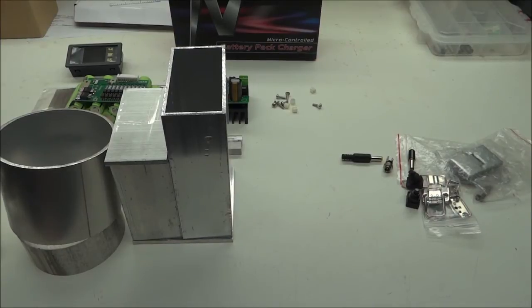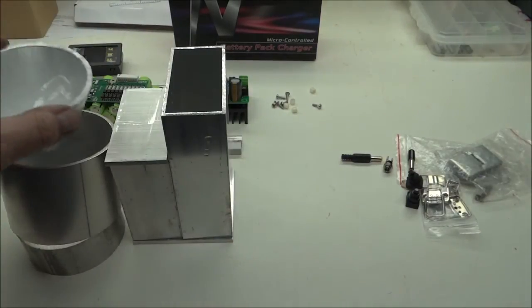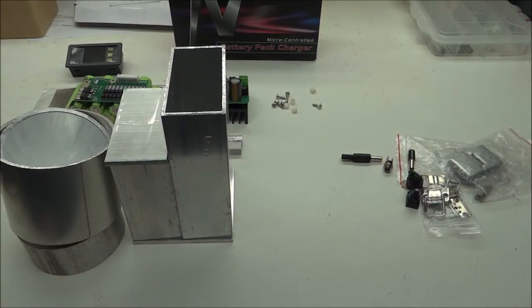That's the idea — a basically homemade from-scratch light. I'm hoping to do at least 10,000 lumens out the front. I'm hoping that with that reflector, since it did such a nice job with some of the other LEDs, I'll at least have a well-formed beam. The beam is going to be huge in diameter — not a tight spot — but hopefully with the faceted reflector it will be a spot and look fairly good. Ten or twelve thousand lumens out the front as a fairly focused spot — nobody's going to care how big it is because it's just going to be a monster.